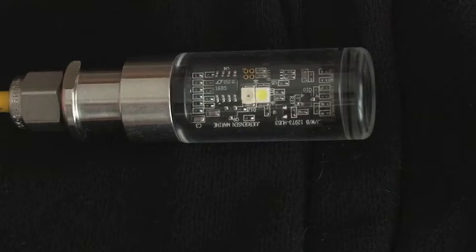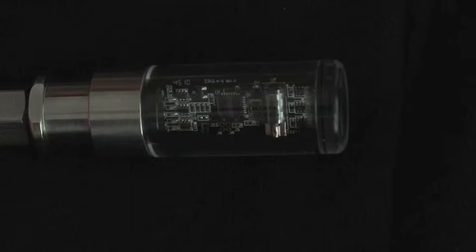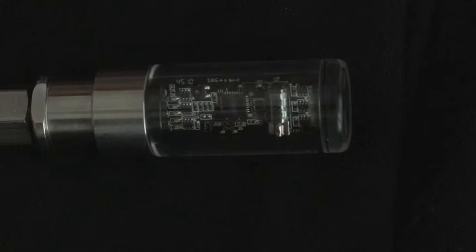For example, when the oxygen concentration of your breathing loop is within an acceptable range, the green LED will glow on and off in a steady, calm manner, indicating that all is well. The frequency by which this glow occurs is user-definable via simple menus, but in the event of an out-of-range condition, the LEDs will exhibit increasingly urgent behavior, allowing the diver to subconsciously process their message.